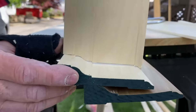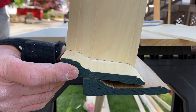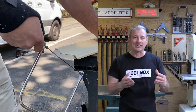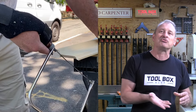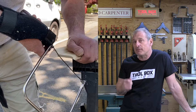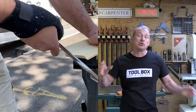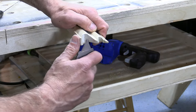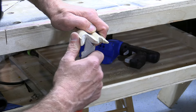The goal is to cut the profile back to reveal the front edge of the molding profile, allowing the adjacent molding to touch only the front edge of the coped piece. Cut off the waste along the way, and when you get to sharp turns in the molding you can stop and restart the cut or come in with a straight cut to remove waste. When done, the coped molding should have a sharp profile edge that follows the profile. Slide it in place over the other molding and see how it fits. You can adjust a coped molding with a back file, sandpaper, utility knife, or a grinder with a sanding disc on larger moldings. Coping inside moldings is a superior, professional practice.